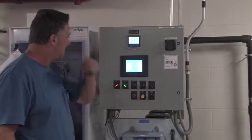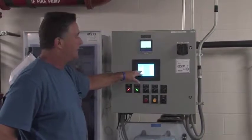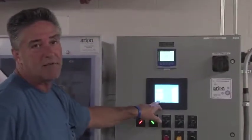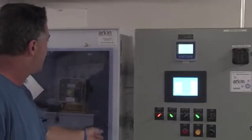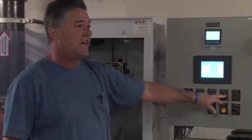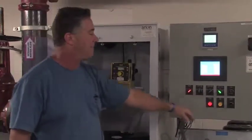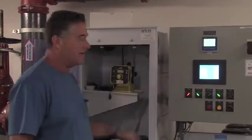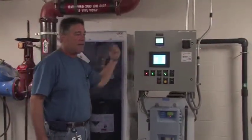So there's a pump in hand right now — you can hear the water moving around. I've got 30 PSI for discharge pressure and about 34 gallons a minute as my flow rate. My totalizer on the bottom is here. Chemical pump — I'm going to turn that to hand also. The unit does get powered up only by the switch and it has to be lit. If this pump fails for any reason, I get my alarm — chlorine pump running without my booster pump — and that clears automatically. So I'm putting chemical in right now, recirculating from the pit to here and back to the pit.